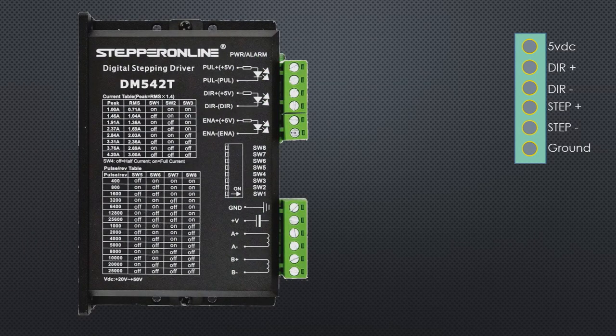You're going to have some kind of stepper controller card, and this is typical of what you'll find. Look at these two enable pins — a lot of them have this. It gets confusing because if you take the enable minus and hook it to ground, and enable plus to 5 volts, you're actually telling the card to disable, not enable. When it's not connected, the card is enabled. It's counterintuitive and it drove me crazy until I figured that out. So if you do want to switch the card on and off, you need to hook it to a signal and invert it — but the easiest thing is just leave it disconnected.